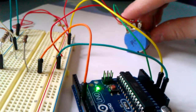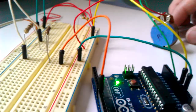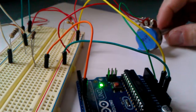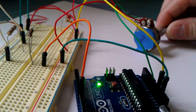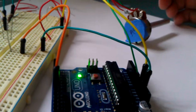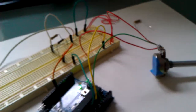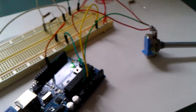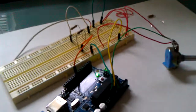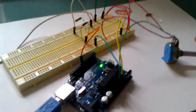I'm going to adjust the potentiometer. You can hear the different notes as it loops through. The cool thing is it won't change the pitch at all until it's looped all the way through — then it reads the potentiometer, makes a new original note, and cycles through again. It's kind of a neat feature that you can control it and have the pitch only adjust once it's completed the sequence of notes.